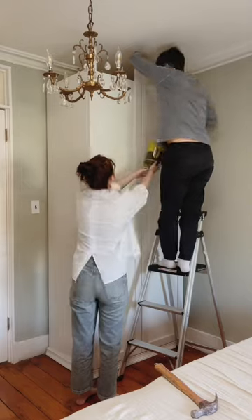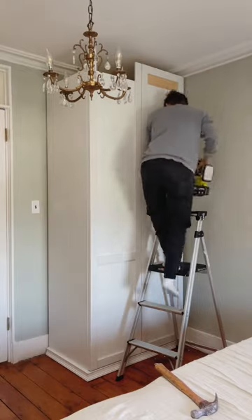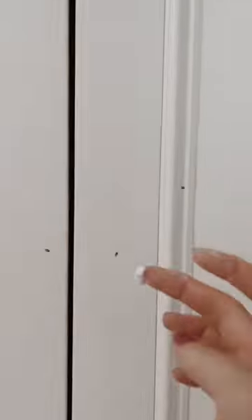To make the wardrobe doors appear taller, we had the vertical boards extend 5.5 inches above and attached a 1.5 inch thick wood plank. We then cut 1 inch decorative moldings and installed them flush against the board.